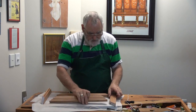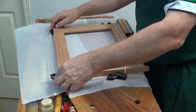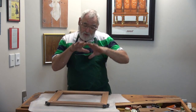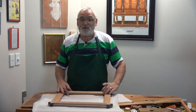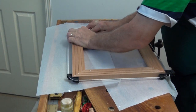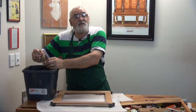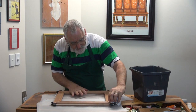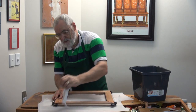Okay, just put this back. Honestly I can't rave about this Nobex clamping system enough — it's absolutely brilliant. Now I was going to show you a way you can marry all these mouldings up, but quite frankly that one worked out well, so there was no need to. But I will show you at a later stage. Make sure they're all in nice and tight. If you've got a bucket in your bench too, put a little bit of water in it — not only is it good for Bob so he can have a drink, but just to clean up any of this glue that sort of snuck through, so we get a nice clean joint.